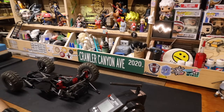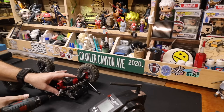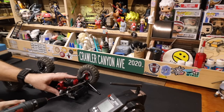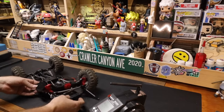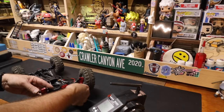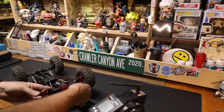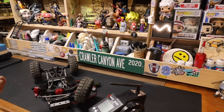This is a fairly common practice, honestly, with chassis mounted steering, even more so with laydowns. This servo is not laid down, but we do have a bit of the laydown situation here, which is we're starting with the servo horn clocked over so that we can run a drag link. See, it's too far over, but we can trim it back to where we need to. I don't care for sub-trim. It is a necessary evil, but if we can get away with not using it, this is why I tend to favor a turnbuckle for the drag link, because then we can precisely adjust it.